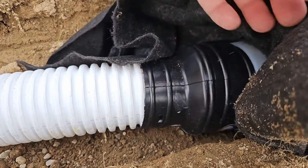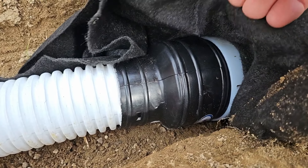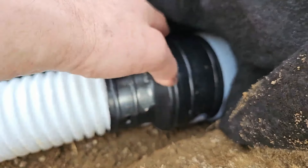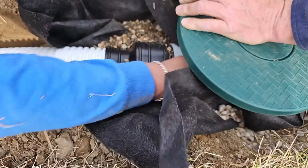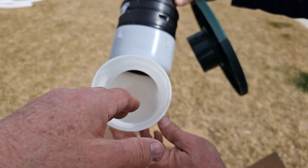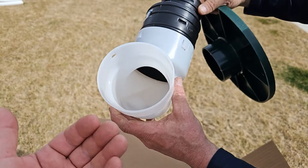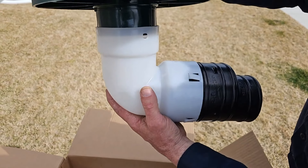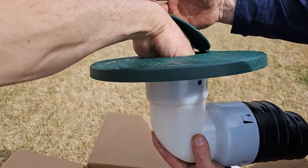We don't tape this and we don't tape right at the French Drain Man's not-quite-a-90 fitting — we let those leak out. In the pop-up, this is slightly ramped so all the debris just comes out; it's a self-cleaning pop-up, the first of its kind. It has a lot higher flow rate and it's the only pop-up you can get your hand down in.